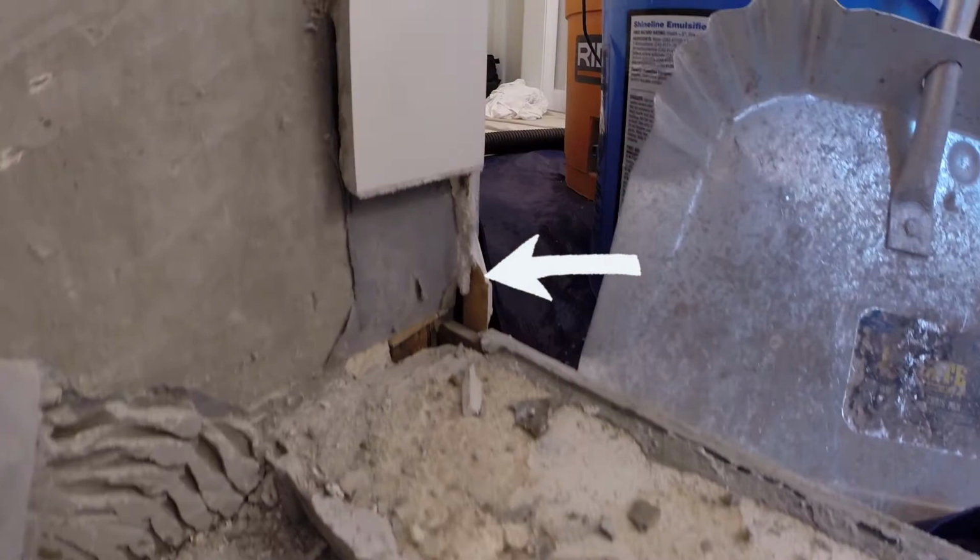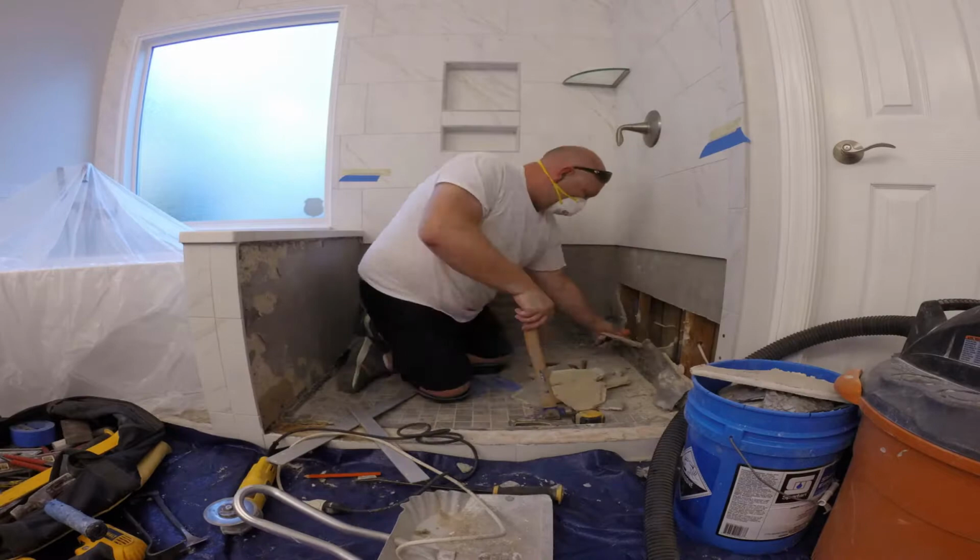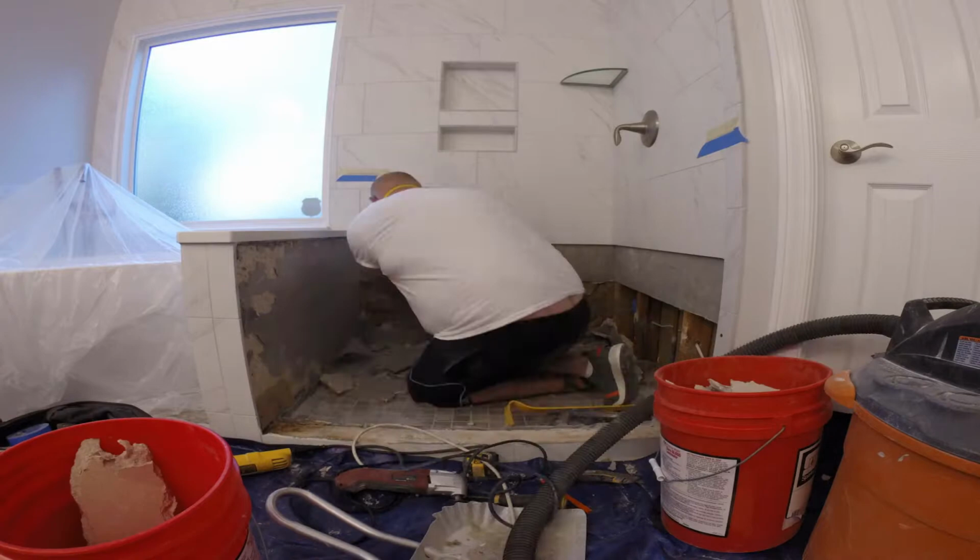On this shower, contractors used the KERDI foam shower pan, and that explains the flat spots on both sides of it, because that pan comes in a 48 by 48 inch size, but the shower was a little bit bigger, so they tried to extend it, but they hadn't sloped it right, so that explained the flat spots on both sides.